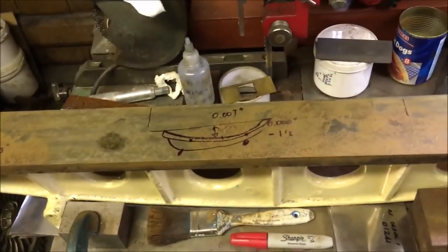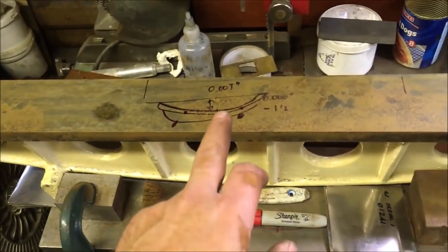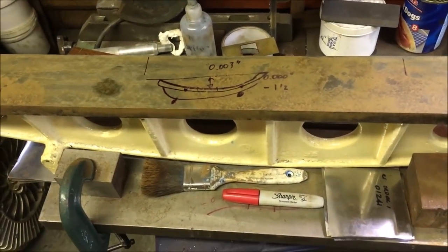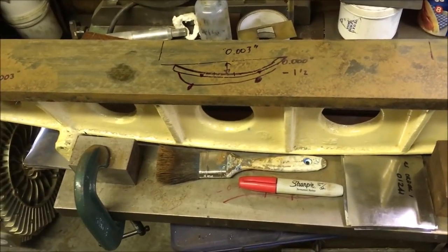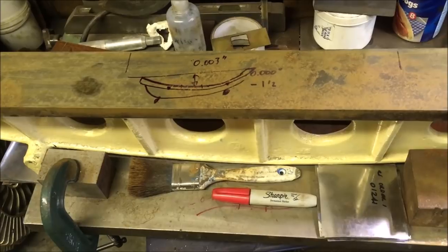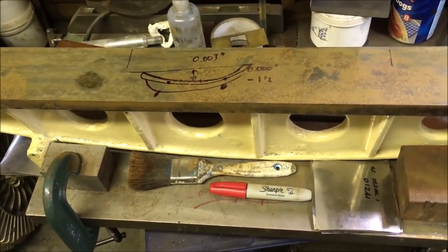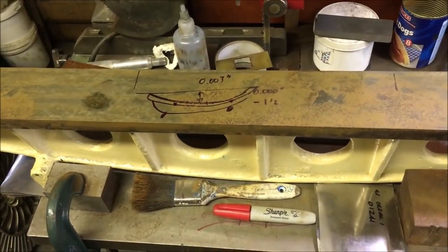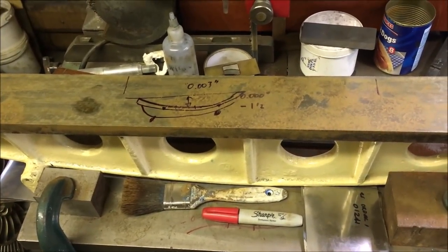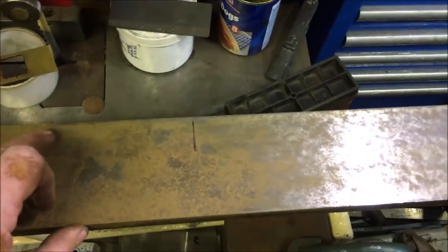These are not in a million miles off that. So that's a hell of a lot of scraping to get that out. I mean, if it was just 3 thou I'd got to take off, that's a chunk. So I'm inclined not to bother with that one. What I really want is somebody that's got that machining capability and that can take 10 thou off and see how it looked, because I don't mind the odd pit.